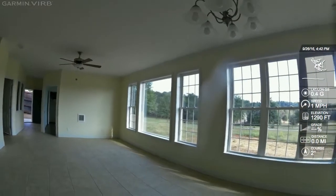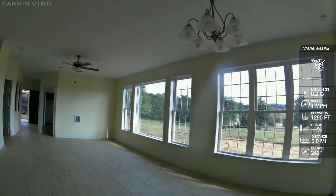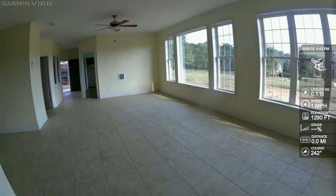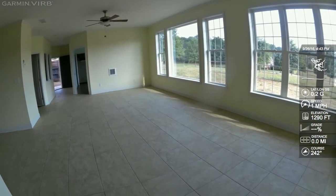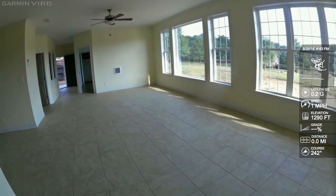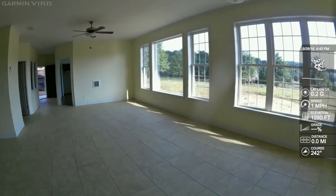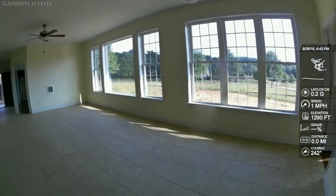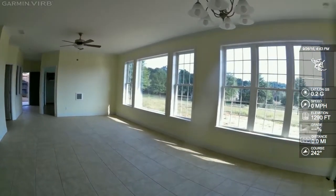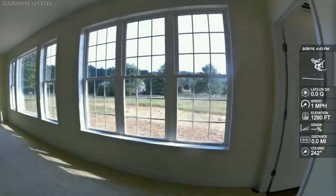This room is going to work like a thermal storage battery. The sun comes in during wintertime and heats up the tile over the concrete slab, and the slab absorbs the BTUs from the sun, releasing them at the end of the day when the sun goes down to heat and radiate into the space. It also acts as a buffer — in a conventional stick-frame house with this many windows the room would overheat, but the slab's ability to absorb heat keeps the room comfortable. Vice versa in the summertime, it keeps the room cooler.